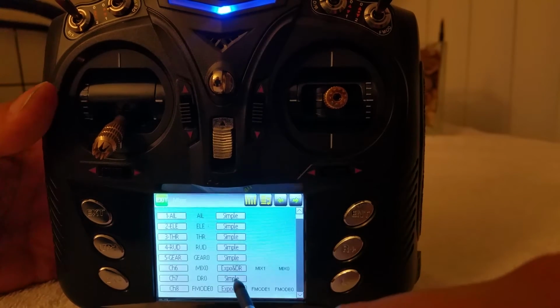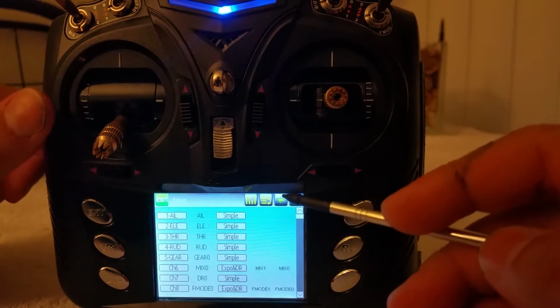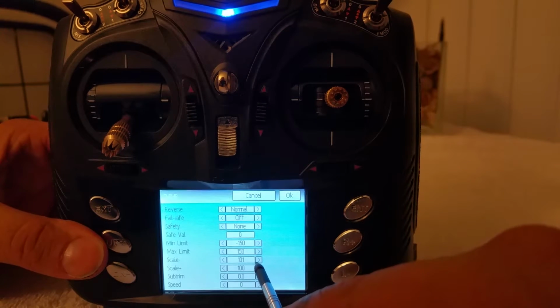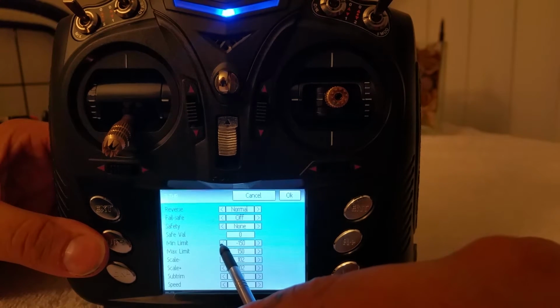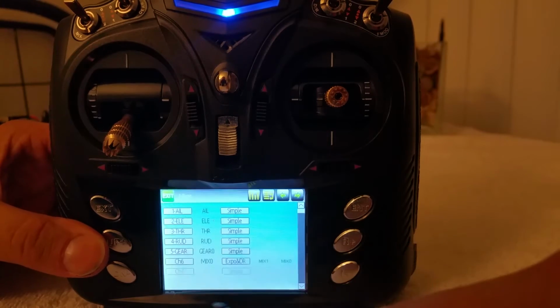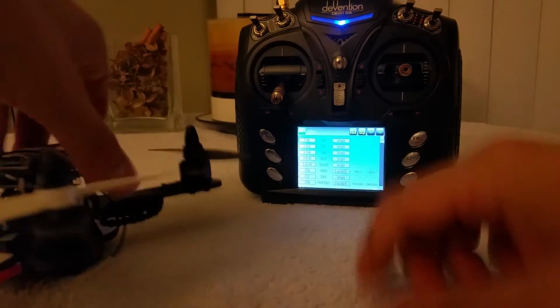Alright, so in this case, your Clean Flight and this radio, they don't play nice unless you modify something in the throttle range. And my experience has been the scale has to be at 102. Great, now I can't remember if it's the minimum max or if it's the scale. I'm pretty sure it's the scale. Anywho, if it doesn't work for you for one reason, try the min limit, maximum limit. But I'm pretty confident it's the scale. You have to put in 102 values. Instead of 100, 102. That's it. Without that, you won't be able to arm your D4R through Clean Flight.